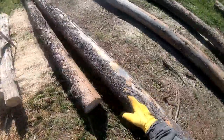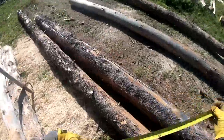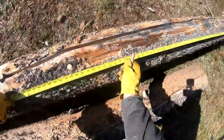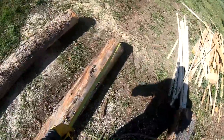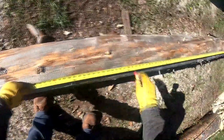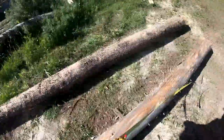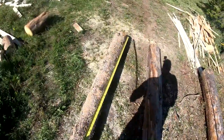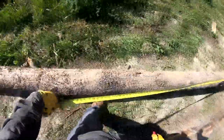It's checked, but I have a technique for cutting up this lumber so that you get rid of the checks when you face it. So what we've been doing is, so we only have to haul out one log at a time, or two at a time, as we've been cutting them 16 footers or 16 foot trees. And then I come in and I cut them a little bit long, 8'1", 8'2", that way we can square off the ends and have true eight footers.